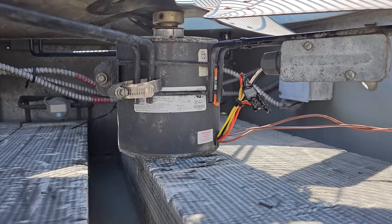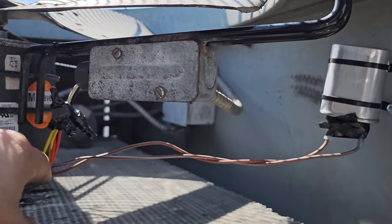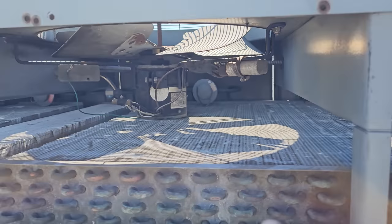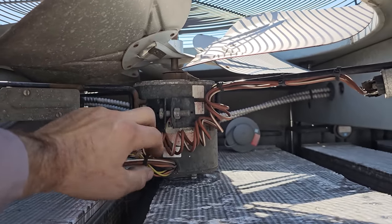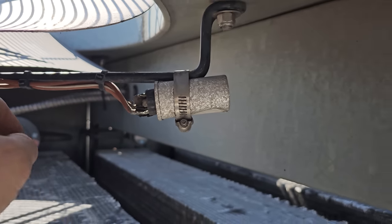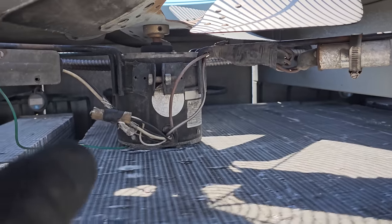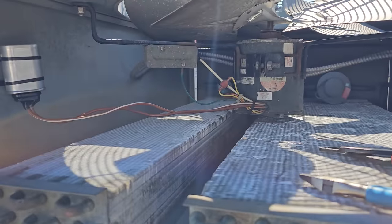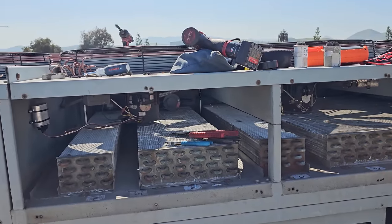We're all put back in here. I mounted the capacitor over here, taped it to keep water from splashing on it, secured all the wires, grounded it — everything's nice and tight where it should be. No longer rubbing. I couldn't leave this other capacitor alone either — it looks like crap, smashed down. You'll rupture the capacitor that way. So I went and did that too. Now we have no potential of it getting too wet. Everything else is good, so we're going to put this guy back together and keep going.